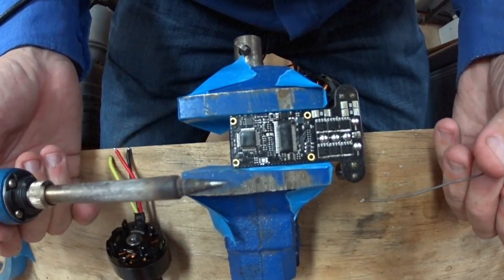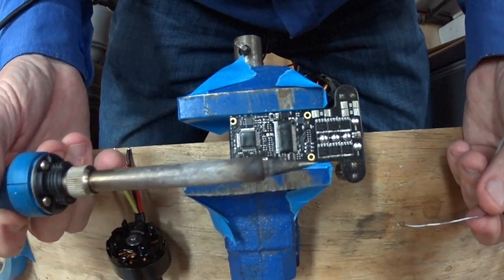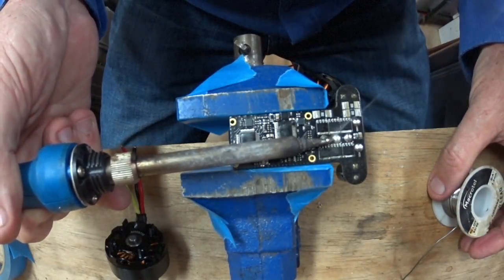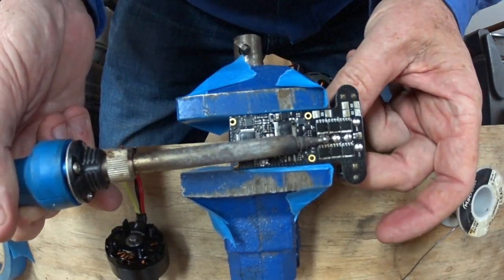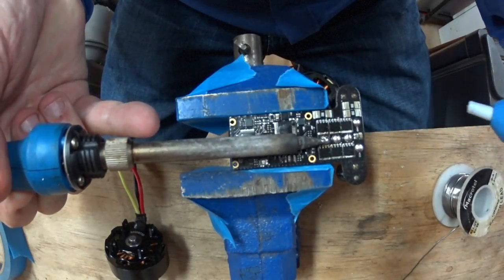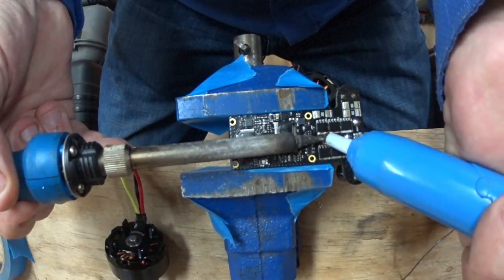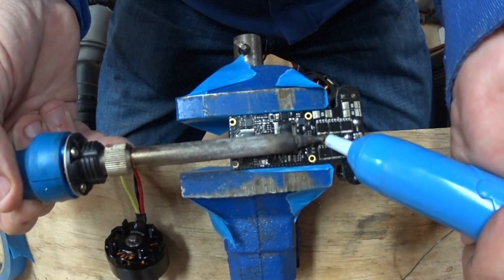That tip looks a bit black because I've got this little iron — I think it's a hundred watt — and it's maxed out trying to melt these things. Let's get in here and see what we can do. It doesn't matter if we melt a couple of these together. There we go, something is turning liquid. We're barely making a dent in it, so we'll use one of these solder pumps to remove as much of this lead-free garbage as we can.